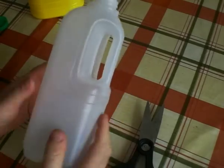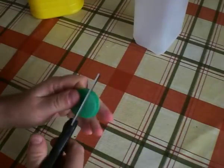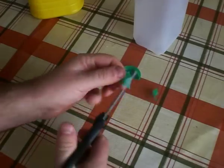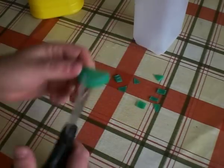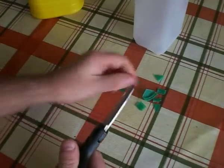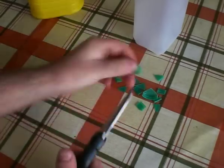In order to process this, it all needs to be cut into very small pieces. With things like milk bottle tops, that's quite easy — just cut them up with strong scissors into little flakes. Some larger bottle tops from fizzy drinks aren't always so easy, but you can use pliers or wire cutters to snip those apart.